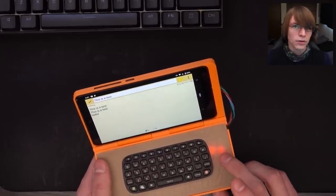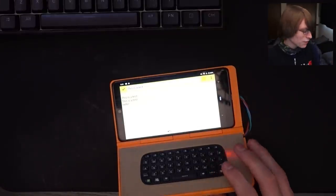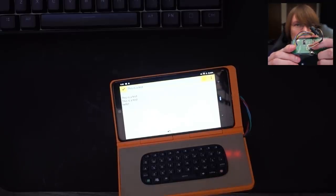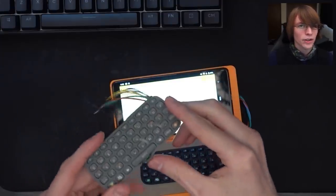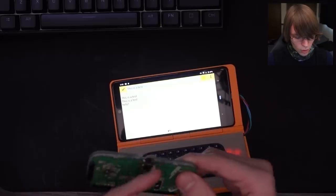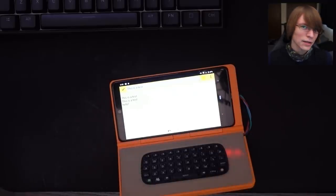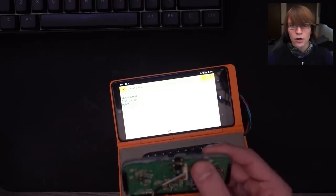You'll notice these red LEDs here — those are actually on the Digispark, and if you wanted to save maximum power you could remove those with a desoldering iron. Speaking of desoldering, I used a hot air station to attempt to remove both of these connectors to make the thing lower profile. The biggest issue was that this plastic has a much lower melting point than what I'm used to, and as you can see it kind of melted one connector and it no longer fits in my project. So I ended up switching to just using a normal soldering iron, heating up all the pads in turn so the PCB itself got nice and hot, and carefully prying up on the plug itself.